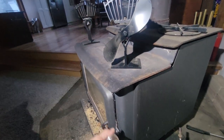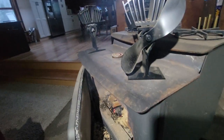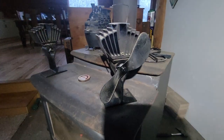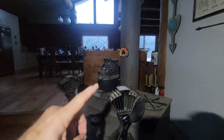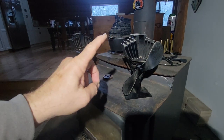Here's the stove. As I open this door you can see all that smoke coming out. I don't have much of a fire going right now — I just put a bunch of wood in there — but what that's telling me is first of all I don't have a big enough fire or hot enough heat to make a good draft go up the stove pipe. But there's also the possibility I've got some creosote buildup up here. I've actually had black smoke coming out and it smells oily — that tells me creosote is getting hot in here.